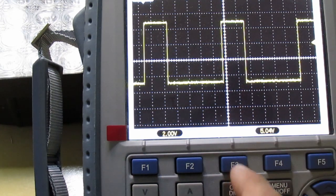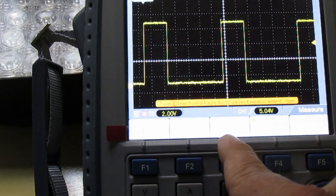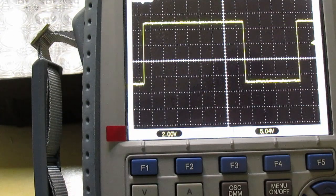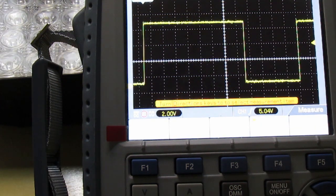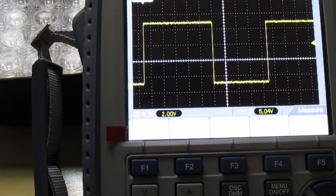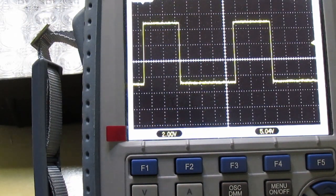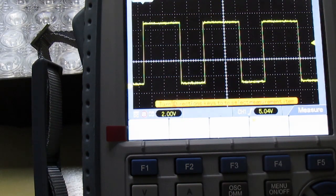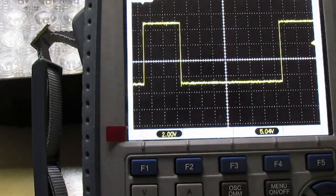So you've got a high adjustment range of, the shortest time is 150 milliseconds, or 0.15 seconds, and the longest high time is 650 milliseconds, or 0.65. So you go from 0.15 to 0.65 on the high. I'll adjust it down here a little bit. Okay, now I'm going to go into the off time. The minimum off time should be the same, 150 milliseconds, or 0.15. The maximum off time is 0.65, or 650 milliseconds.